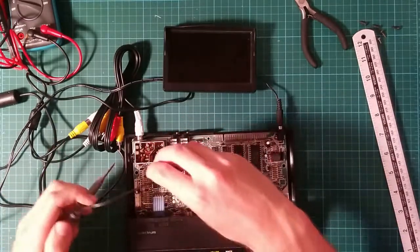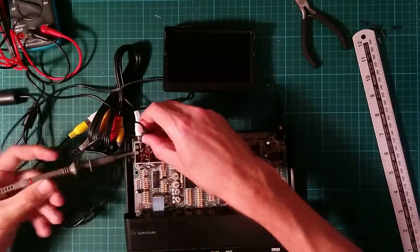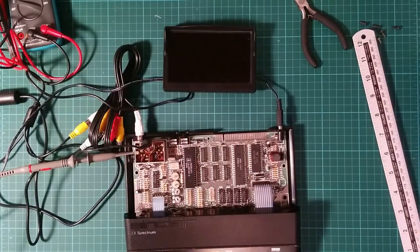So we want to connect composite out. 3 volts. Want that to go there, and that to go there. That's ground to signal. And we can see it's 3 volts, so twiddle this one until we see that. Twiddle this one until the video signal syncs. It's not happy, actually. DC? AC? I can see a signal, and it's about the right size. Let me set that to ground.